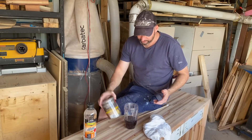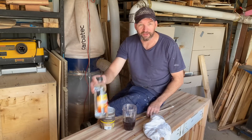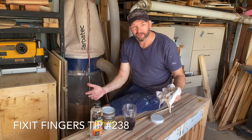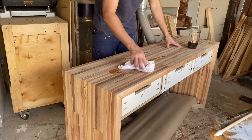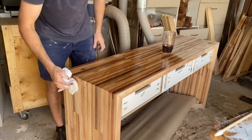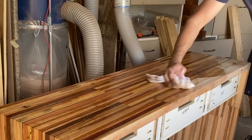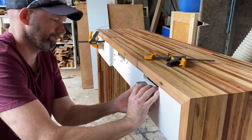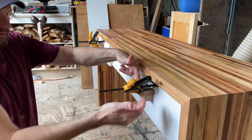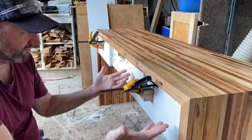I'm going to finish this one with just an oil-based poly — a generic brand. Mix it up with a stick and a bit of turps to thin it out, just to create a wipe-on poly. I think that's all this one really needs and it turns out pretty cool. This is all pallets — Merbau pallets, about 7 metres long. I've got a heap of them and that's where most of this awesome colour comes from. There's no pine in it because we want it to get as dark as possible. Pine does cop a bit of unnecessary hate though. The beauty of having hand-hold cutouts in the drawer fronts is you can actually clamp the drawer front on in this fashion.